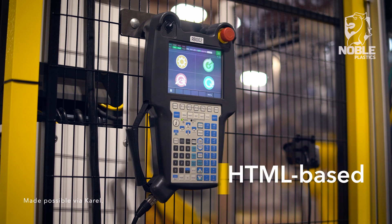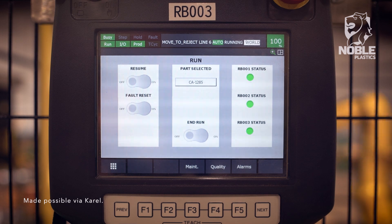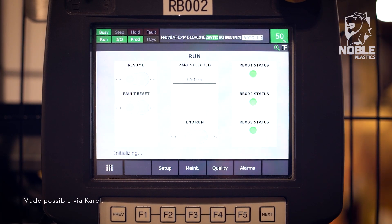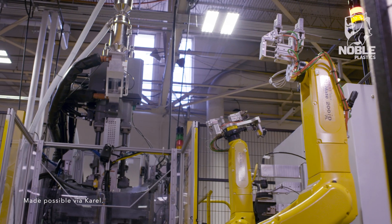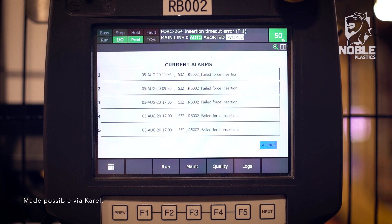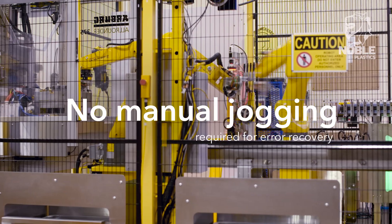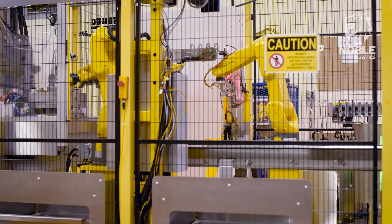The system utilizes the HTML-based HMI functionality of the teach pendant for the operator interface. This functionality is mirrored on all three teach pendants, providing operational control from multiple locations around the cell. If an error occurs, the operator may choose to correct the issue and continue production, or may abort production, in which case all robots deposit held parts into a reject location and return to a home position, allowing easy access to the cell. A comprehensive user alarm system gives contextual information for most stoppages or faults, and such error recovery does not require manual jogging of the robot. The system makes use of intelligent interference check to ensure collision-free recovery motions.